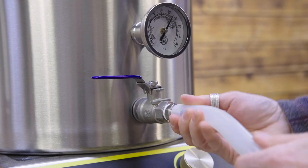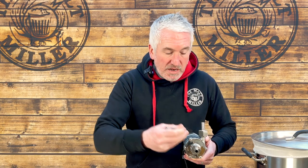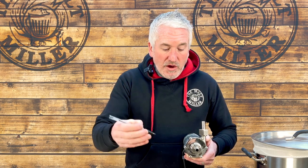There are some considerations to make sure that doesn't happen. The inlet of the pump — regardless of the design — is always at the bottom or below the outlet. When liquid enters the pump it pushes the air that's already in the pump out so that the pump can prime. So the number one rule is: don't run a pump dry, and prime it properly by running liquid in through the lower port and out through the higher port.